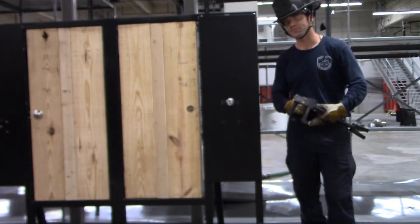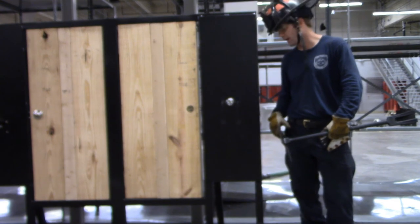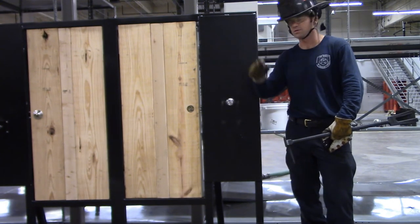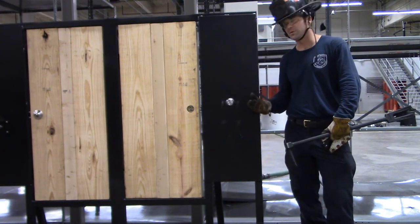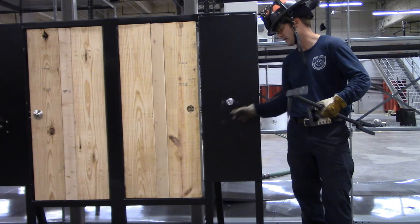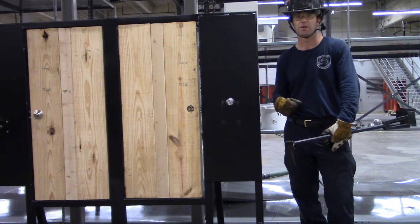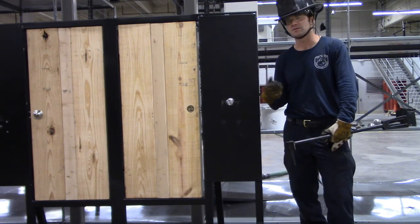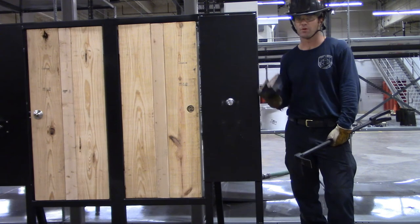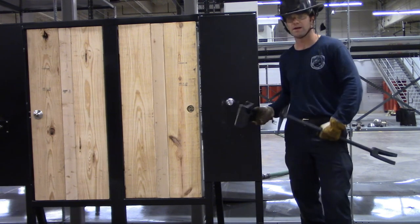Now we'll talk about pulling deadbolts. It's going to be pretty tough, but it's definitely possible and something we should be good at. When pulling deadbolts, there are two screws - either number six or number eight machine screws - that run through the back, and we're just looking to break those off. Anytime we pull a deadbolt we should plan on some damage, whether that's from the K-tool causing damage around the deadbolt, or a rabbit tool tearing up the door jamb and trim. Either way there will be some damage, but it's another option we should be good at. Same as commercial locks - whichever direction we approach, that's the direction we pull.